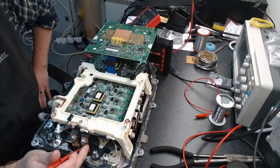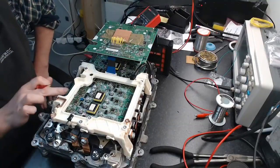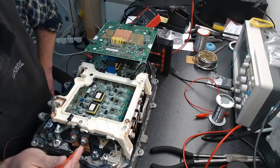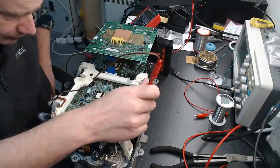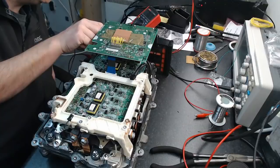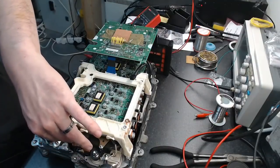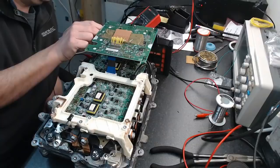I'm going to make a fool of myself on national television, am I? It looks like I am, because maybe these bricks don't have anti-parallel diodes, which we can still beat. But what you should see is that one of these should give us a positive from the diode test function. No, it's not, which is not reassuring. Okay, over here on my... Oh, of course, because this is the booster converter. What am I doing? I'm an idiot. Sorry, these aren't the DC leads. The DC leads are on this side. That wouldn't have been very smart of me, would it?